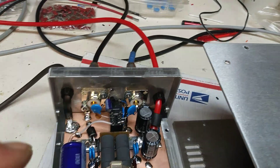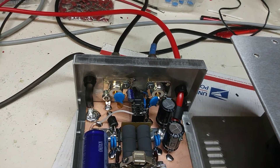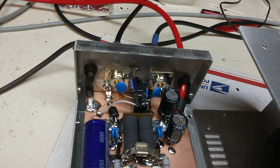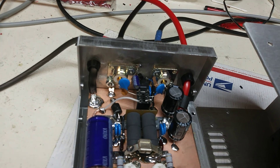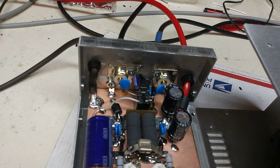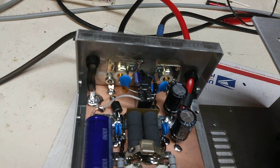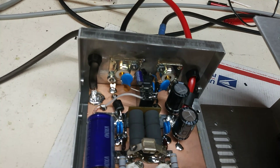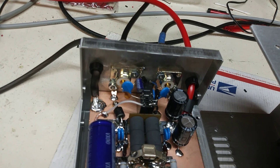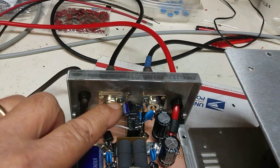I put a 5-amp relay in here — you all know I love doing this. The reason is that I had a two-pill base where the relay was wanting to lock up on me. For some reason or another it was the only one doing that. I sat back and scratched my head thinking about the old school stuff — they've got capacitors going to the input and output. So I did that to the two-pill base.